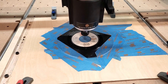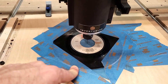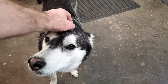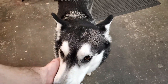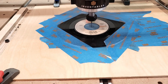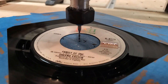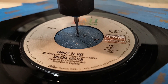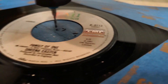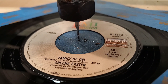My setup is blue tape, then double-sided tape, then blue tape on top — blue tape upon blue tape upon double-sided tape. I'm just realizing that because there is no disc in the middle, I'm going to have to use my Z-probe on the side and then move it back to the middle. Let's do that now and see how it goes.